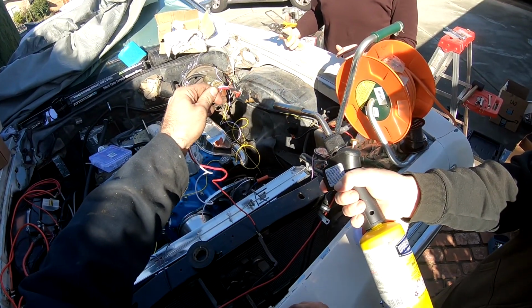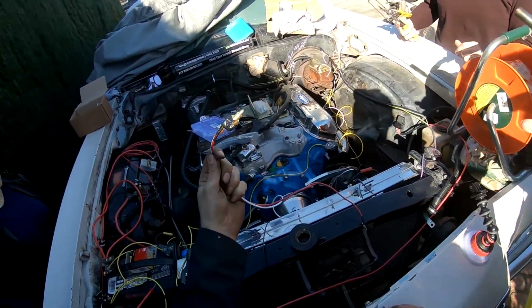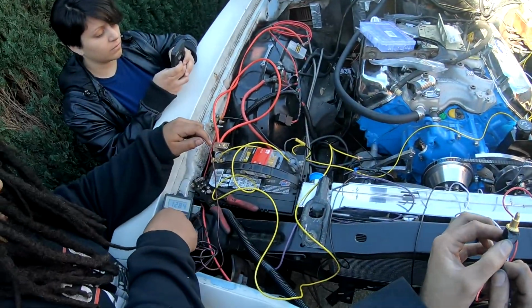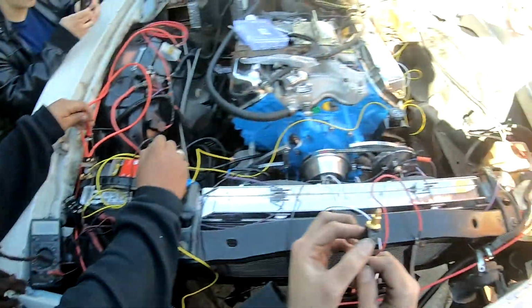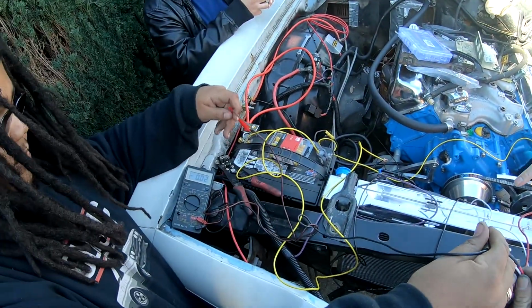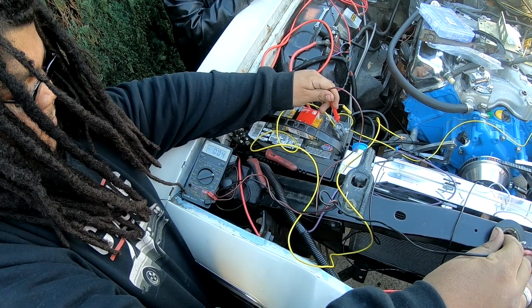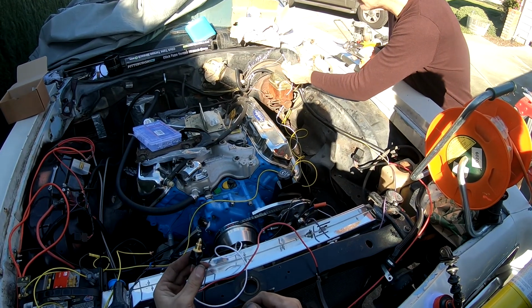Yep. Stop moving it. Pretty hot right there, guys. Nothing? So, I looked up there. You got your voltage there, right? Yeah, and check from the tip to the ground to make sure that contact is good. From the tip to ground? Yeah, and then see if you get any continuity there. You get anything? Yeah, good. All right, so that's good. And then this is going to center here. That tells it to turn it on.